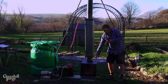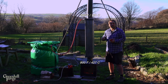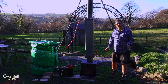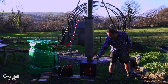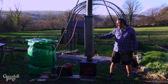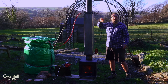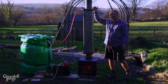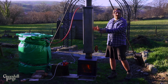Right now the exhaust gas coming out down at the flue is about 800 degrees Fahrenheit, and up here after they've passed through the coil they're at about 250 degrees Fahrenheit. So it really is extracting a lot of heat out of those gases. This is completely cool to the touch. The reason I have a damper at both ends is because if for some reason the water stopped flowing, I'd need to protect the copper pipes — I could switch off the damper right here and that would ideally stop most of the heat going through. The damper at the top is there so that if I wanted to slow the burn down I could close it off, and I could actually create a heat dome or heat bell inside here that captures the heat and lets it soak on the copper pipe.